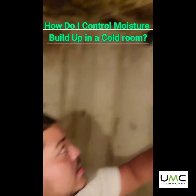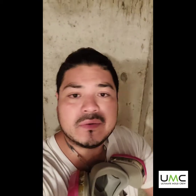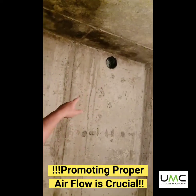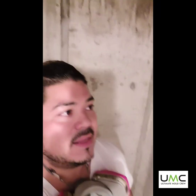Unfortunately, these rooms are semi-blocked. You can see these two holes up here. These two holes should be within the cold room — there should be some sort of air exchange. Even one hole is okay, but if you have two it's better. You want air exchange coming in, and then one air coming out. That all depends on what you're going to be storing in here. If you're storing a lot more items, it's better to have two.